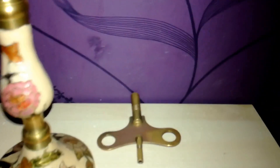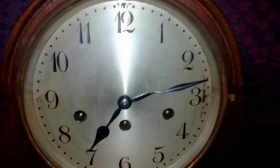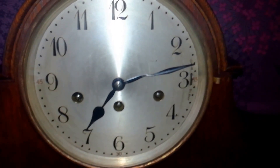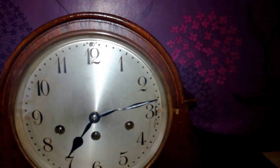Oh, and the key — there's the key. Obviously, the big end goes into the key winding arbors, and the little end, which is like a pocket watch sort of size, is for adjusting the slow/fast mechanism for fine tuning. I've got this set exactly in the centre — from the centre there's exactly one and a quarter turns either way. I've got that set exactly in the centre so I can make all the adjustments on the nut at the bottom of the pendulum bob.